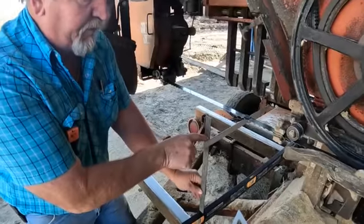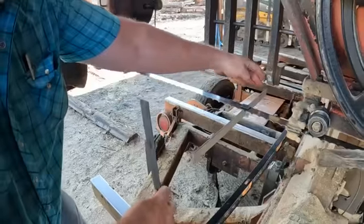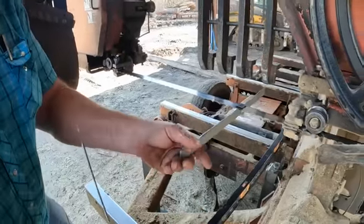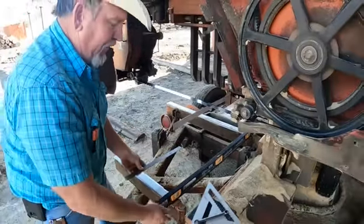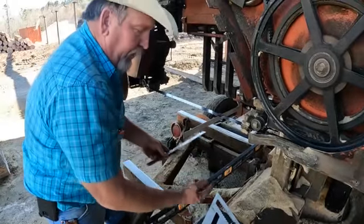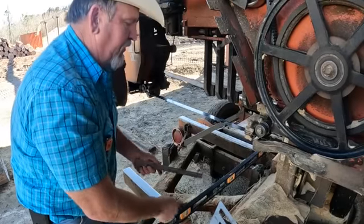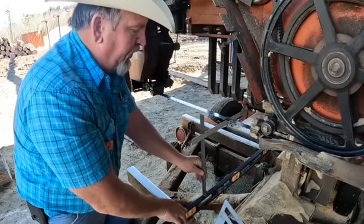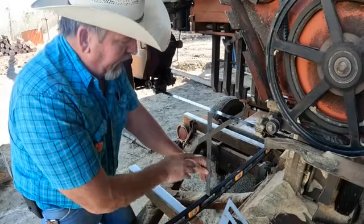One of the things I recently learned — yes, I'm still learning myself — I would put my blade guide alignment tool on there and pick one of my bed rails, normally the one I had more access to, and I would measure up from that bed rail to the top of the blade guide alignment tool. When you clip your blade guide alignment tool on, make sure it is in between two teeth in a gullet.